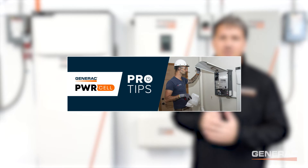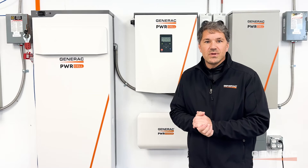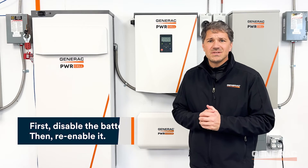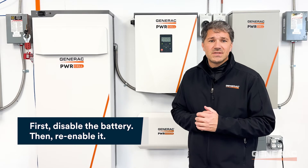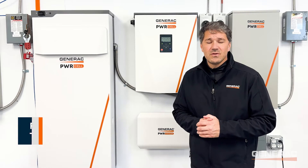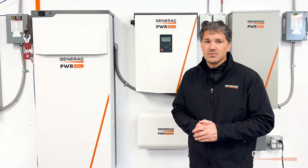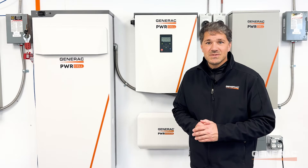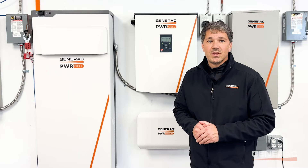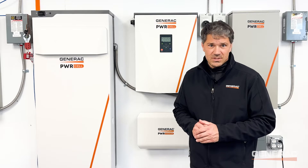Today's topic, we're going to be troubleshooting a battery in error 7000, or also stuck in waiting. To troubleshoot, first disable the PowerCell battery, then re-enable it. If the battery status shows connecting input for a prolonged period after re-enabling, this video will help you troubleshoot. However, if the battery goes right back into error 7000, the steps in this video will not apply — contact PowerCell Technical Support for further troubleshooting in that scenario.